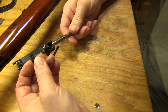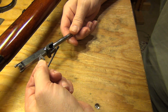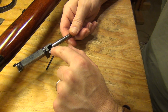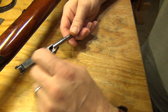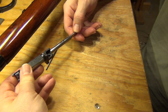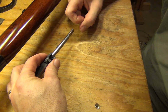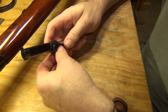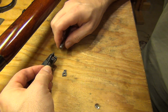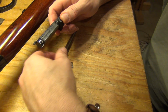They just use a key, kind of similar to the old camming arm, except it's very short. It's just a key, and that key just pops up in there. It's held there by the same pin that holds a toggle in place, and now the two are separate, attached. And that can move a very little bit, just enough so that when the hammer strikes the back of that, it'll knock the firing pin forward enough to set the round off, and then the spring returns it to the back position. So some people are unaware of that, thought it was kind of interesting.